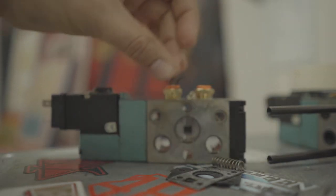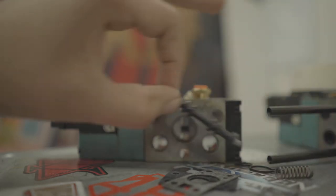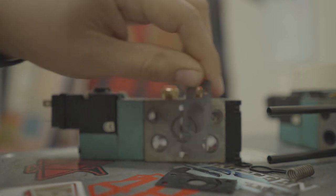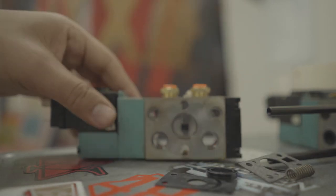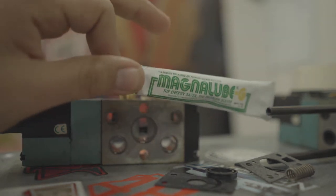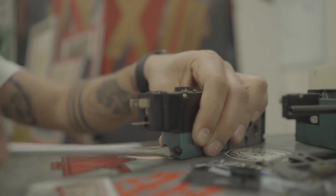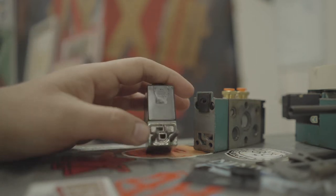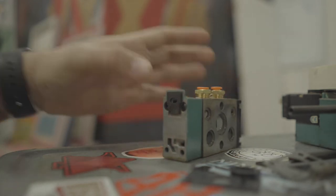This little tiny gasket goes over here on the end, then we have the spring that goes right here, the piston goes right in the middle, this gasket goes right here in between these two, and then the cup seal goes right in here. The main thing is to make sure everything is nice and clean — get all that debris and oil out of there — and then simply lightly lubricate everything with the special lubricant. The gasket that goes here was not part of the kit, so we just wipe it, take it out, clean it, and put it back inside.